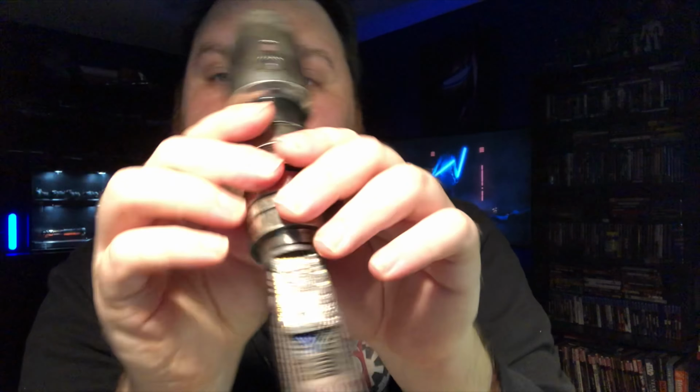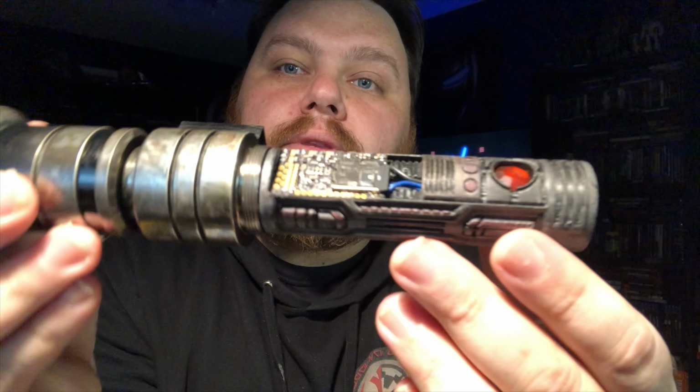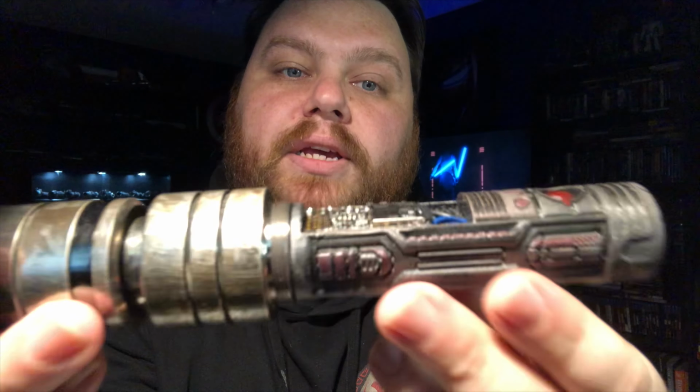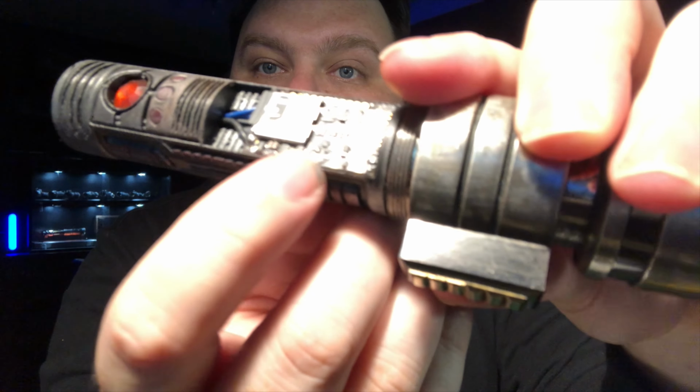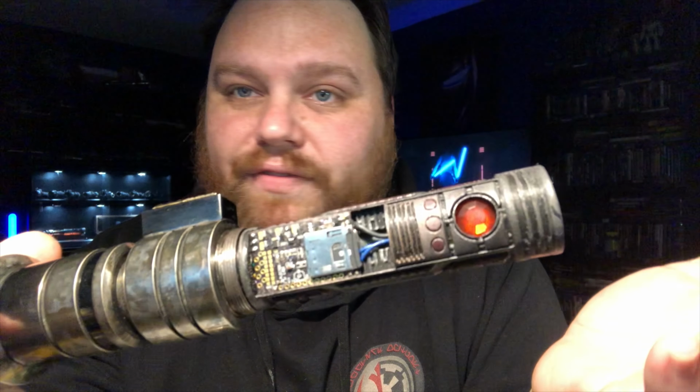You got your CFX in here. The CFX in the cradle was very tight. So because of the resistors on the side are super close, I had to file a corner down a little bit on this board, which is a pretty old school technique. But the board is E6000 down. So if you don't ever really want to pry this board up, it's fine where it's at.